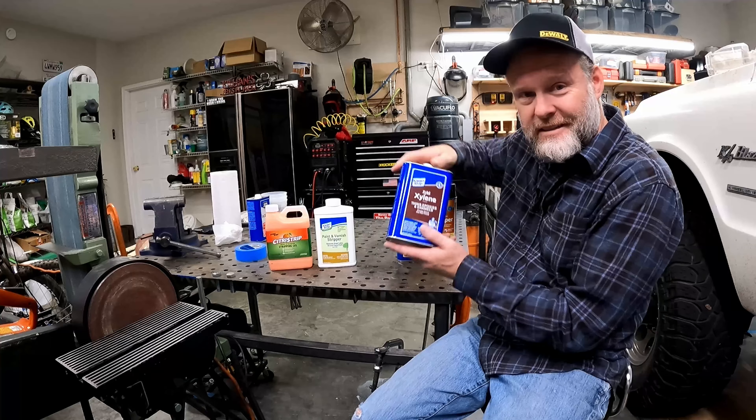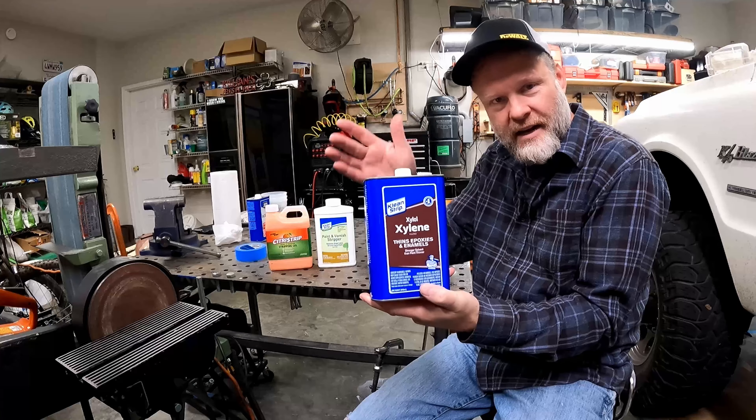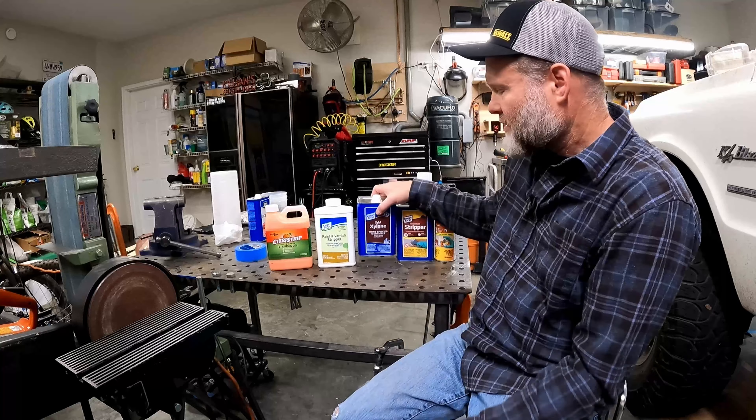The other stuff is Xylene. I don't think this is a paint remover — it's more of a paint thinner — but I thought I'd give it a try. It's not something you brush on and wait; I think you put it on a rag and wipe the paint off. It's supposedly green and slightly less damaging to the environment. It says it takes about 30 minutes, so I'm assuming that means double. It also says for oil-based coatings, allow additional time up to 24 hours.